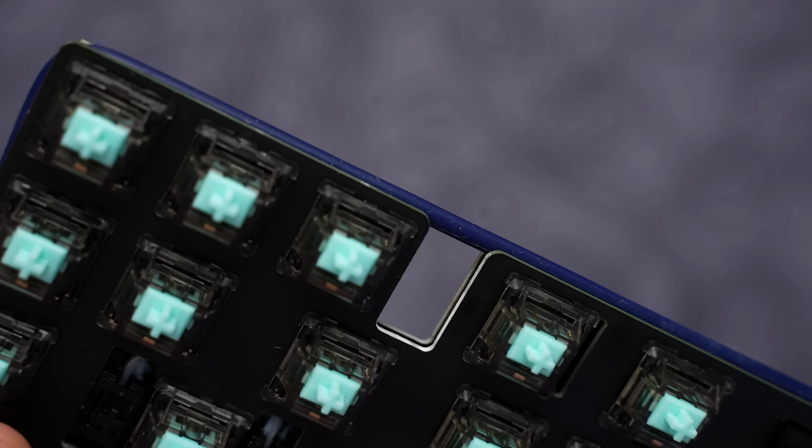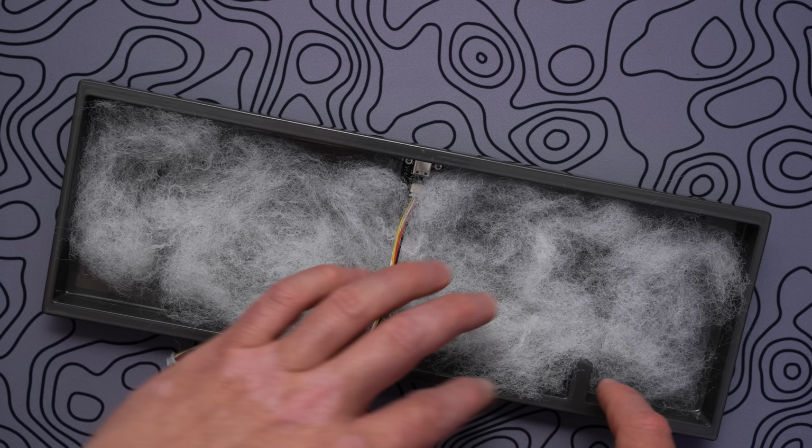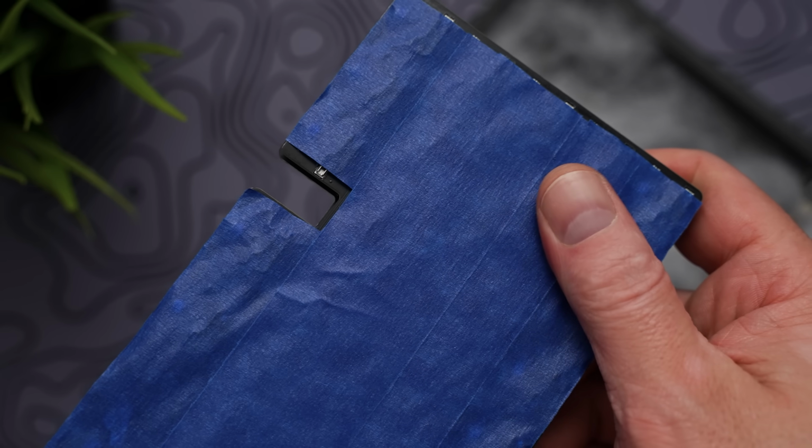It does still have that hollowness there, but it's got a lot more character than the silicone, and you get it without the weird metallic timbre of the zinc weight. Of the available O-rings, I like the 30A ring the best, but we're gonna stick with the 50 ring because it's included in the kit. First, we'll try just adding a little polyfill, then we'll tape the PCB as well.